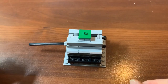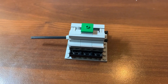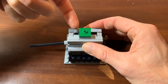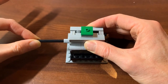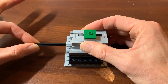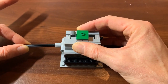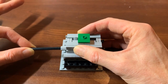I'll just show you a few more details about the Dobson's block — I've now disconnected it from the engine. There's the little stop or pull dropped in there; if I pull on that now, that's not going anywhere. As this slides across it just releases it, and then when it comes back the stop drops and pulls the valve along.